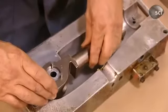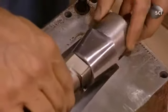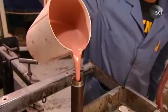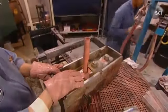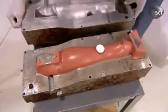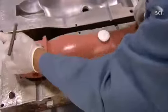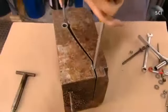The long bones and load cell forms are inserted into aluminum molds. Then workers bolt the molds shut and pour in liquid vinyl. The molds bake at 170 degrees Celsius for 10 to 20 minutes. When they come out, the first step is to cut away flash, the excess vinyl that oozed out of the mold during the baking process.